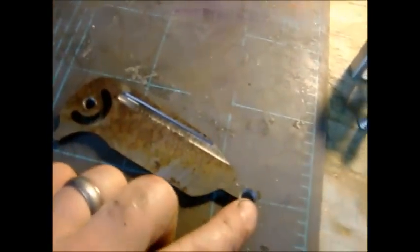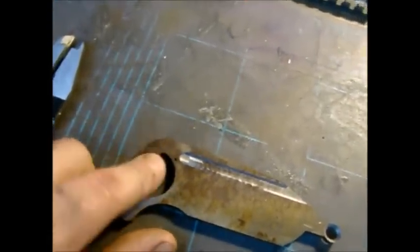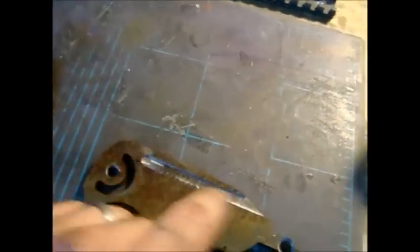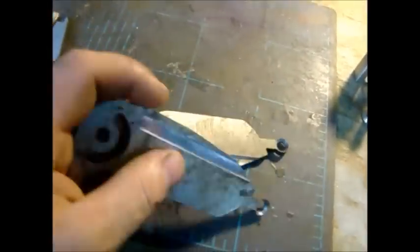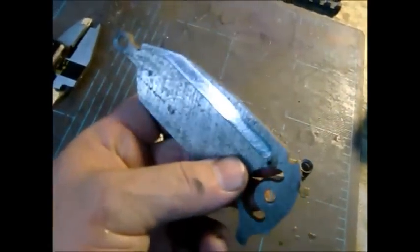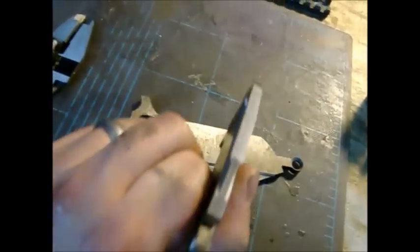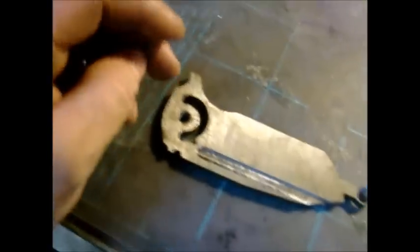What I'm doing now — I've already drilled and reamed the pivot and the location hole for the jig. I countersunk this one, and this one is just reamed out. What I'm doing is cutting the fullers on both sides. I've got one finished — this was the first piece to double-check everything. The fuller is 50 thousandths deep on both sides. If I can get a good picture of that — there we go. The whole point of this jig is dead nuts even, all the way across. I did that through the location sections on the jig.